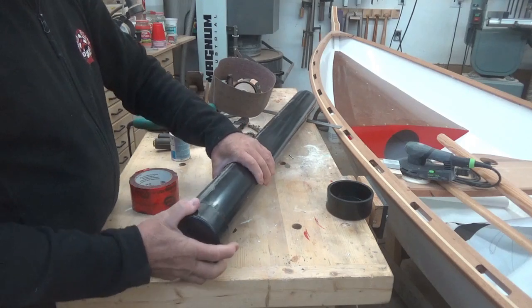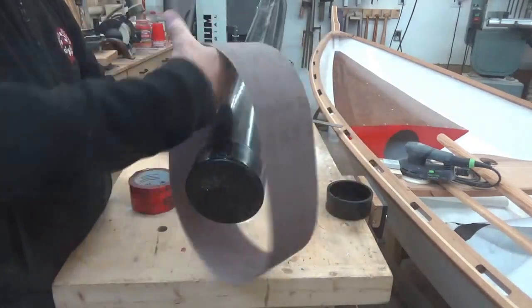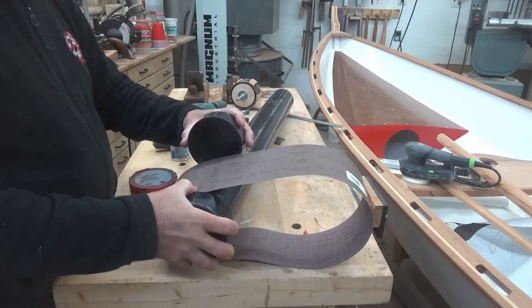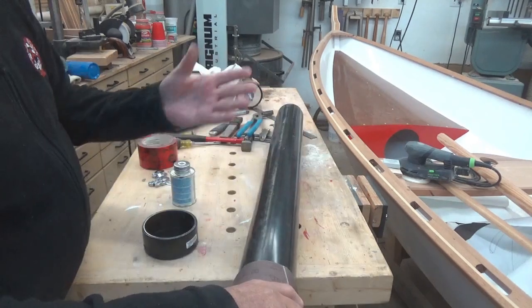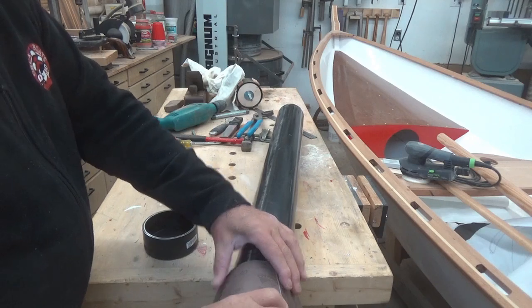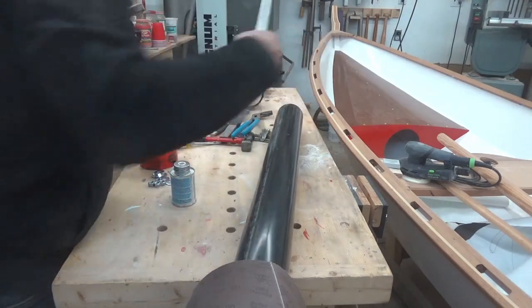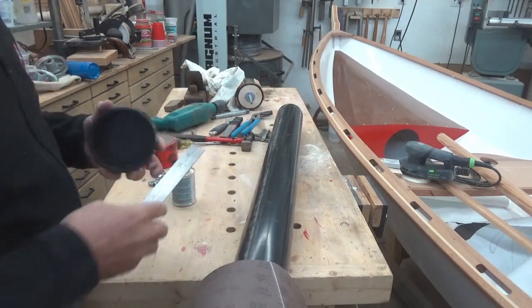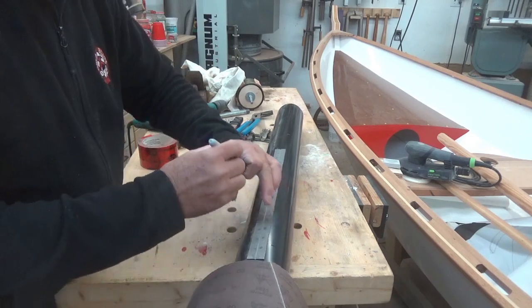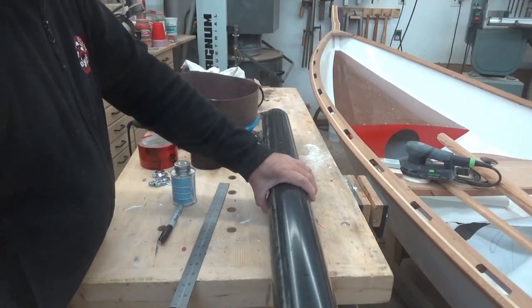Second plan is I am going to glue on with ABS glue a cap. I'm then going to calculate the width I need to cut for another cap to go on, and then the belt will ride between those. I can use a narrower belt that would fit onto the hand belt sander versus the wider one that sits on my stationary sander. I just need to measure how far that goes in - an inch and a half. I'll add a tad bit more so the belt can run fairly freely through there. I'm going to cut that off there with a handsaw.